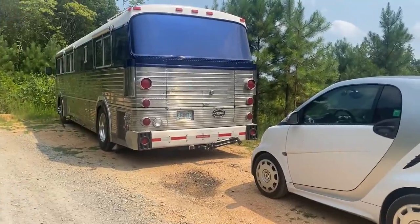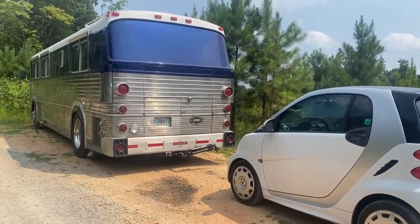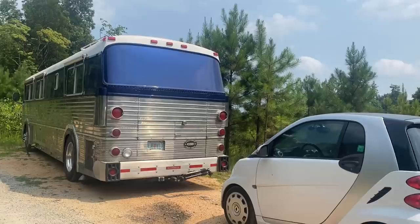Anyways, the bus, we're working on that. He's got problems. There's a wheel seal leaking, actually an axle shaft seal, so we're gonna replace that. That's no big deal. And then the main reason is, here's his Jake brakes. One side of his engine, the Jake brakes are not working, so we'll get into that.